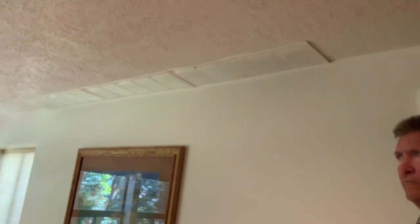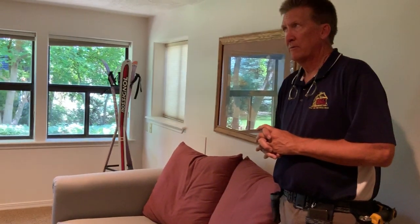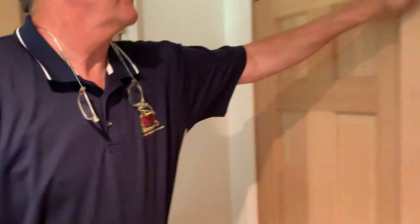And then I thought that those return air vents were interesting in this room. I wondered if they had configured this after the fact. Well, now remember, the basement is different here in that they spent more money to put in all your basement ductwork. Oh, yeah, in the floor. Sure. I pointed that out, that's nicer because they're not in the ceiling. But they do have cold air returns in this room and in the other bedroom. Right. Which you usually don't see. Well, here's why. It's taking heat off the ceiling. And you don't have air conditioning down here because you're concerned about heating. Usually your cold air returns are in the low part of the wall. That makes sense. And so having it up here, you're taking back the air at as hot as it's going to be, so it doesn't logically make sense.